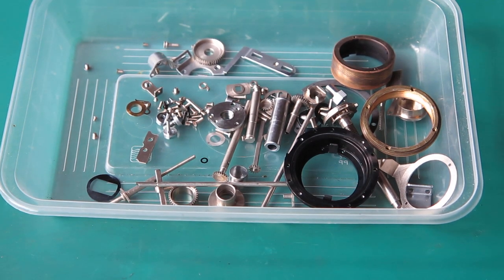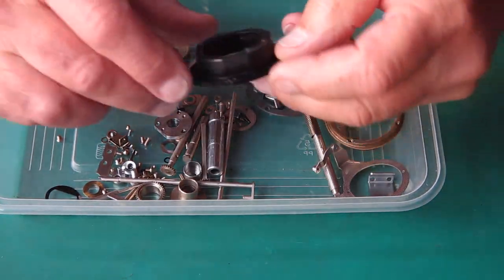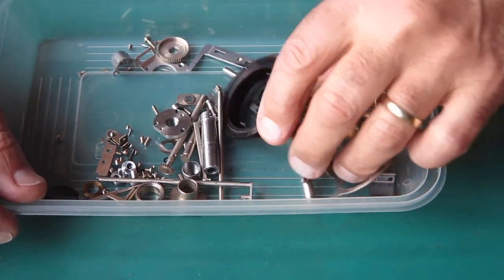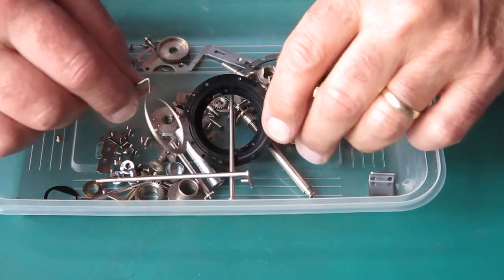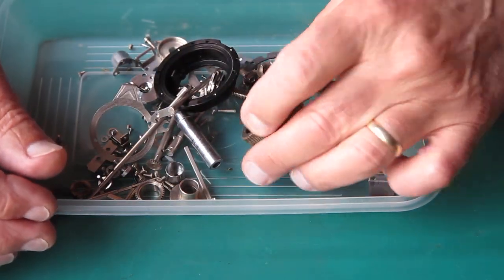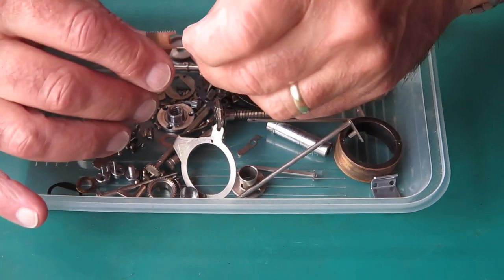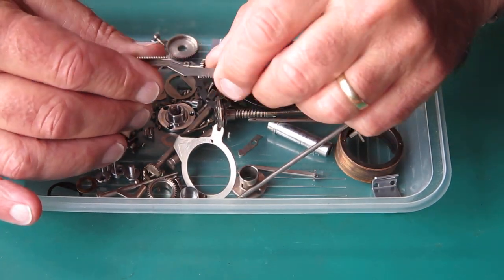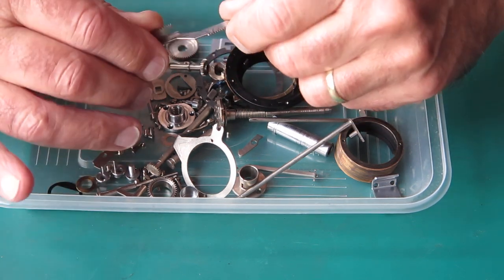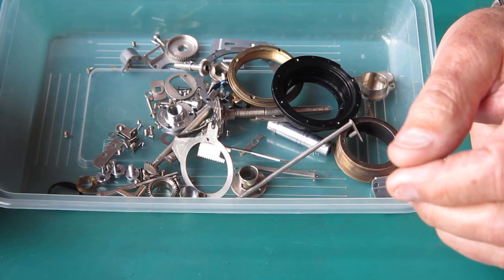The mechanical parts are back from the cleaning process. They were cleaned in the ultrasonic cleaner with wax and grease remover, then again with hot water and domestic detergent — in this case, Handy-Andy. Now they're all clean and shiny, which means critical parts like the shutter cocking rack can be inspected properly. As it happens, that rack is perfect — there's nothing wrong with it at all.